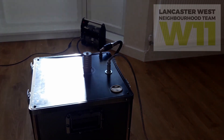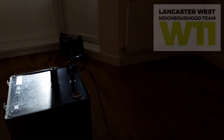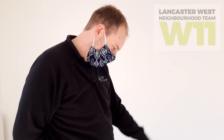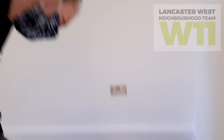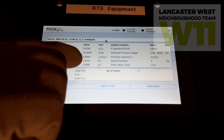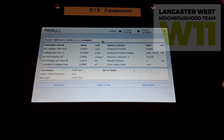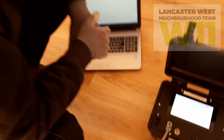Three pulses in total. The sensors are all in the control box, which has an internal computer that calculates what happened with all the results, and they come up on the screen. We've got an air permeability of 0.65 cubic meters per hour per square meter, which is actually pretty airtight. That is the end of the test.